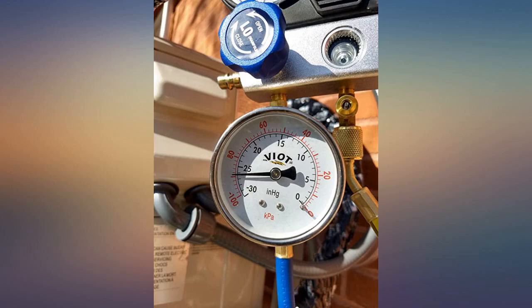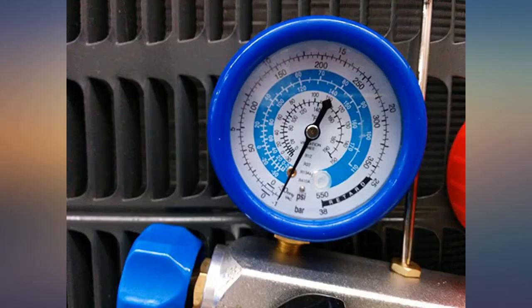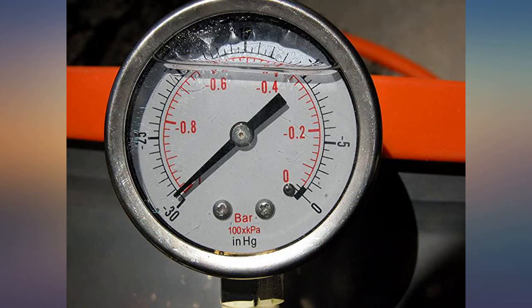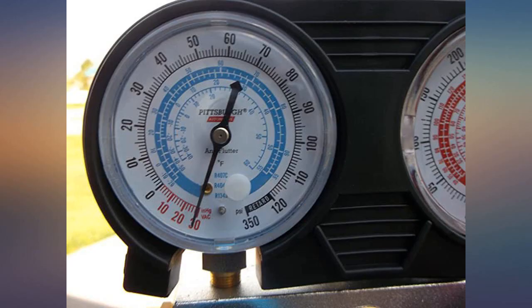Good price performance value. I've seen other reviews complaining about overheating because of continuous running. For AC systems this should be a non-issue. You should only have to run it 15 minutes at a time at most to achieve a deep vacuum. If you look at the pictures, you need some sort of vacuum gauge in line and after the shut off on the AC manifold.